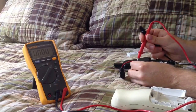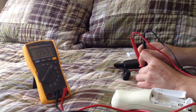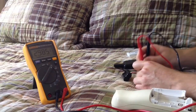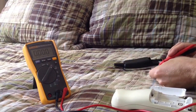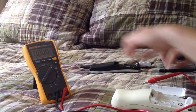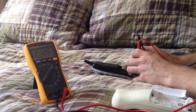These are kind of difficult to measure — sometimes you've got to go into the top and get a better reading that way. We're not getting a very good reading here — there we go: 2.98 volts. So it's a fair bit above 2.4, but that's typically expected. Now I'm going to measure what's supposed to be a 3.6 volt one — and this is only measuring 2.2, and it's actually dropping as I'm measuring it. So this battery is definitely not sustaining its charge the way it should be.